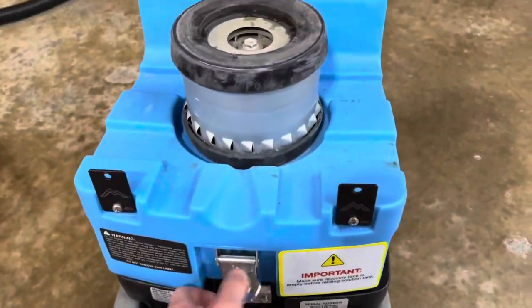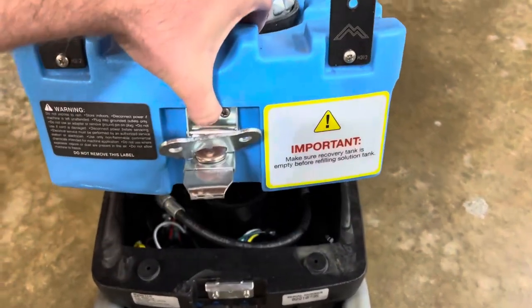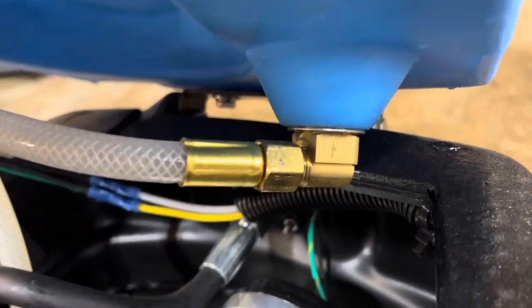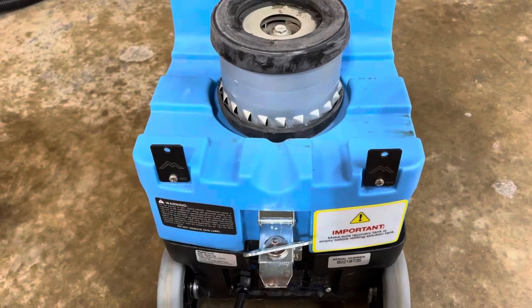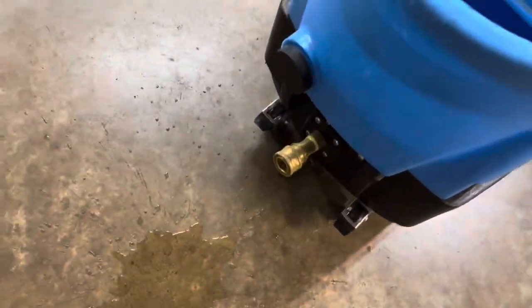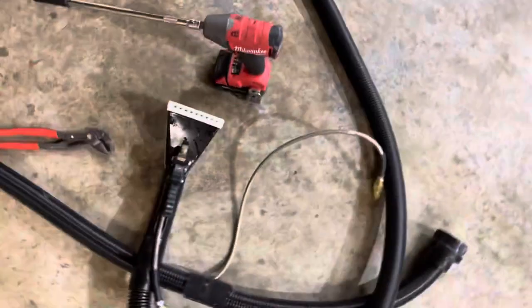Real quick, I'll show you another thing that I think has been an issue for a while. Even when I first bought this thing, I was like, the water pressure is good but not as good as I expected. Right here — if you take this fitting off, there's a little O-ring that's supposed to sit in there. That O-ring had been sucked into the opening — basically closing the orifice going into the pump inlet. So I fixed the O-ring, cleared the tip, and now I'm getting great water pressure.